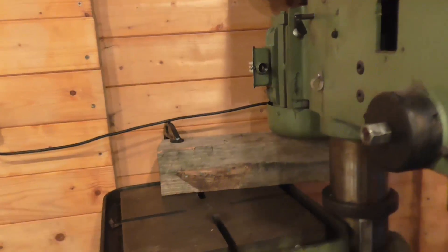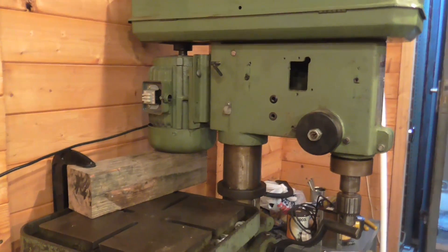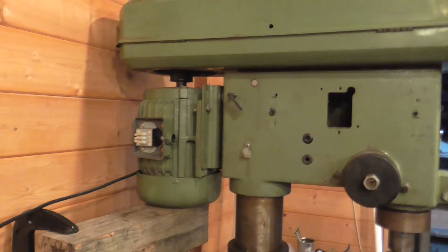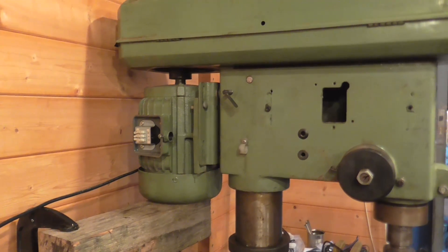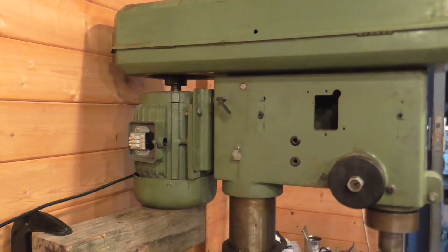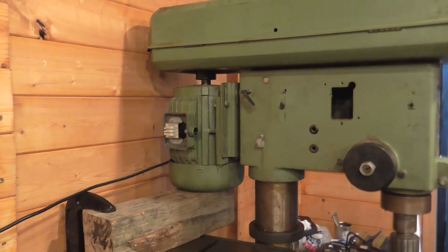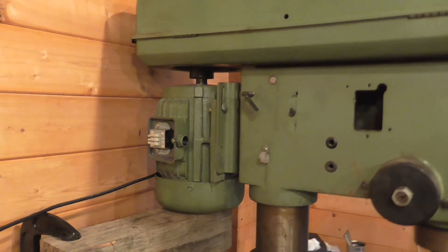What I'm doing at the moment: it's a three-phase machine, which never bothers me, but the motor on it is 415 volt only — it's not a star-delta 240/415. So I'm just setting up to take it off, and chances are I'll be able to open it up and find the star point and rewire it as a delta for 240 volts and run it on a VFD.